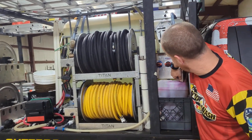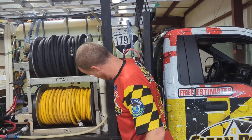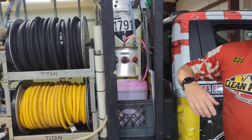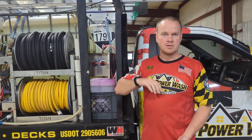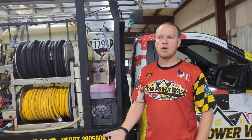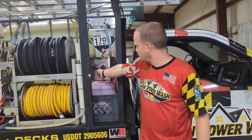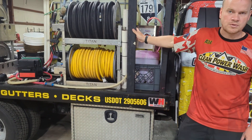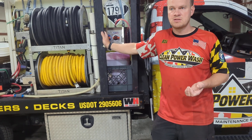This thing is called a proportioner. It enables us to take our mix and go from house wash to roof wash to deck — whatever it needs to be. If a house is horribly dirty, we may use a stronger mix. If a roof is really dirty we bump it up, but if it's not that dirty, we don't need as much bleach. What we're doing for this project is 2% — it's all commercial with heavy duty staining on some concrete block.